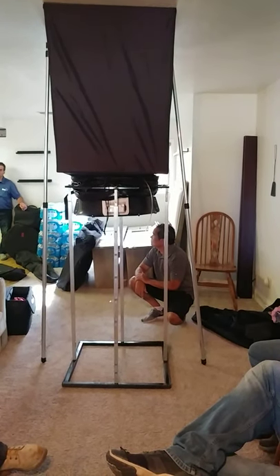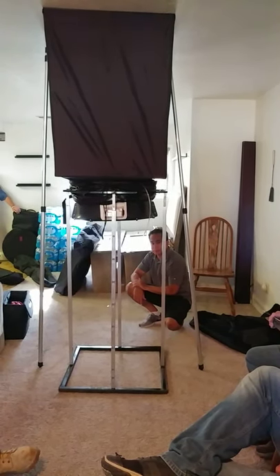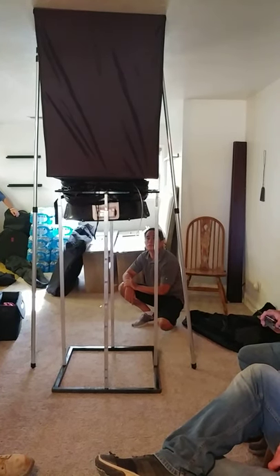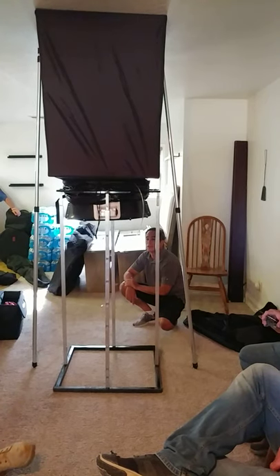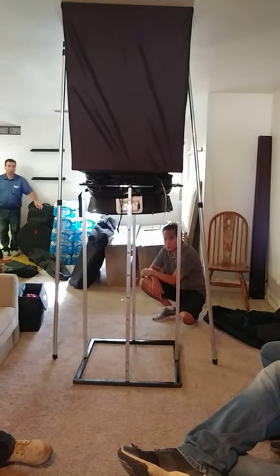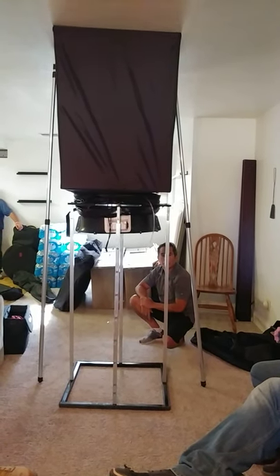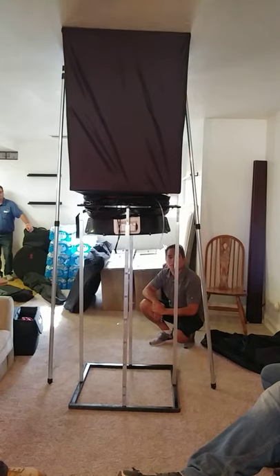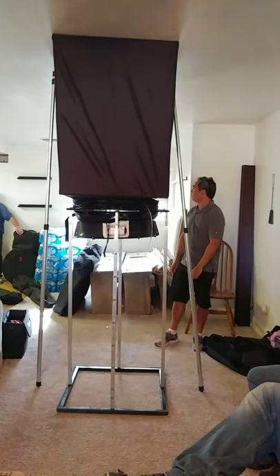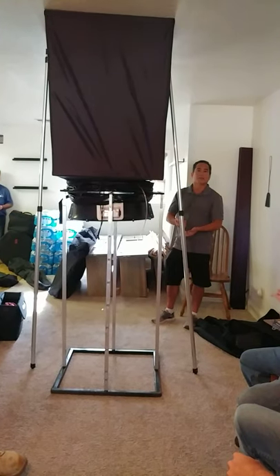We're trying to minimize how much room we take up in our cars. The original prototype — you wouldn't believe — I had to hammer things out with the engineers. Not everyone drives a truck; some independent graders drive Priuses or smaller cars. Even if you imagine a passive flow hood that you can hold and push to get the measurement — there's no way anyone in this room can hold this fan with a hood attached up to a ceiling, control the rheostat to zero it out, and read the CFM at the same time. It's physically impossible — that takes four hands.